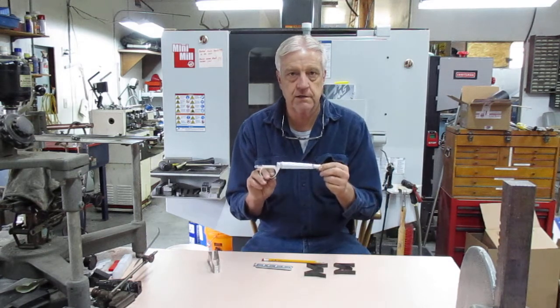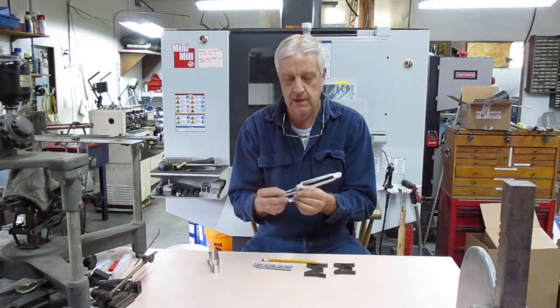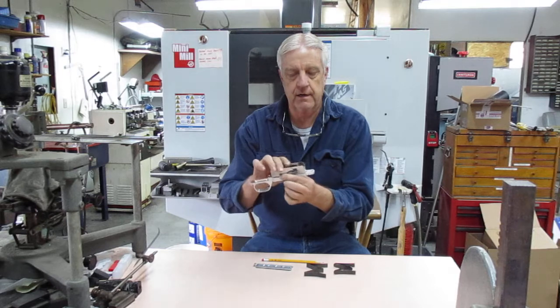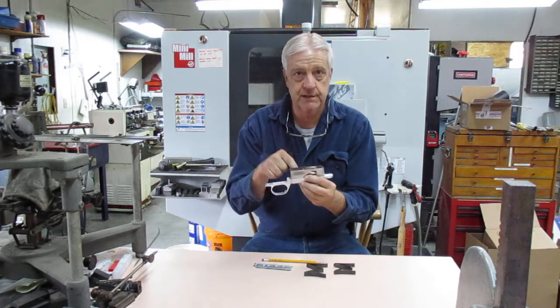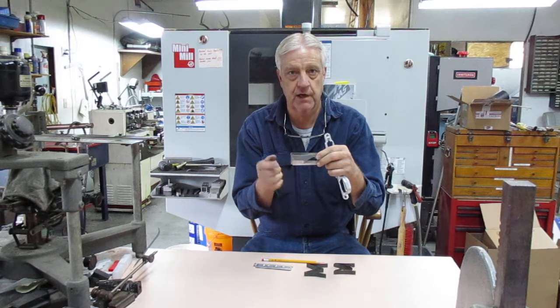I have a Hawkins hinge floor plate here. I've got the bottom metal off of it, or the floor plate off of it. So if you were to take an extended box, put it in this Hawkins, and you look at it, along the front and the sides, the magazine box actually sits in the mortise cut that Andy's put in there. At the back, you'll notice the back of the magazine box has a square notch cut out.